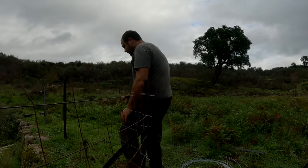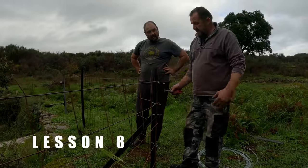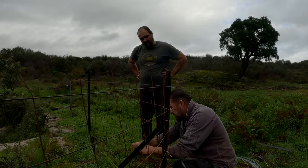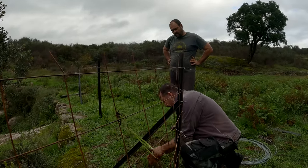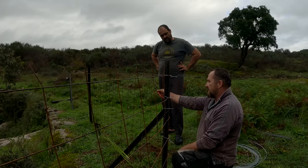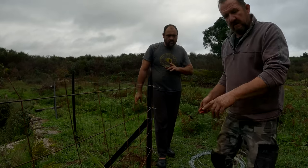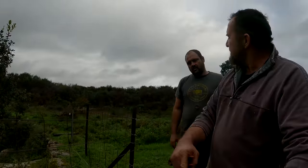Awesome. Well, it looks pretty good there. Quick tip, if it goes downhill or if it is a bit slack, you can do this. That tightens it. And if you find you've got slack spots in it, you can do that in the slack spots. So if it's going downhill, you can do it the other way, so it steps downhill.